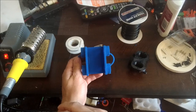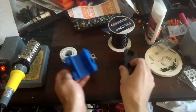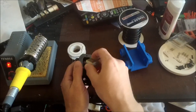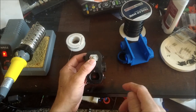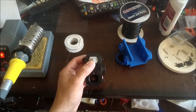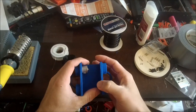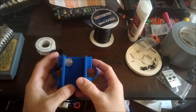So as a result, I'm not going to solder everything while it's physically in here. I have a spare 43 millimeter cage from Containment Crew. I'm going to go ahead and pop the motors in place, solder all the relevant wiring in place, put all the bits and pieces of shrink wrap on there, and then I will end up taking it out and putting it in like so. And hopefully, doing it that way, there will be enough room to fit everything in at the same time. If not, well, I'll have to redesign something.